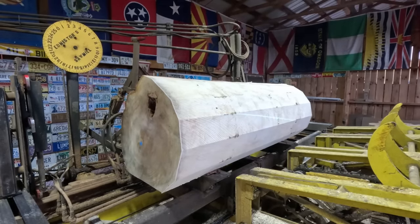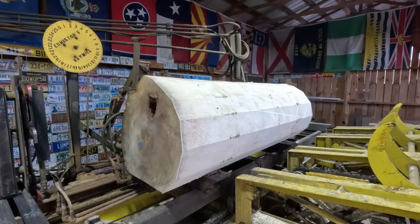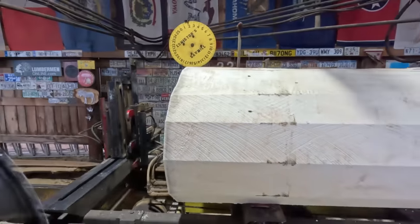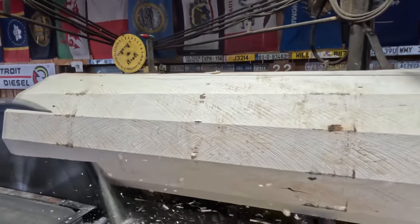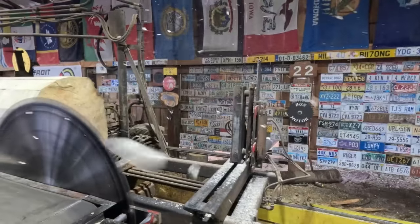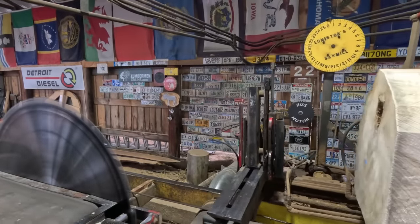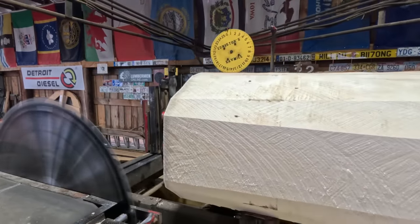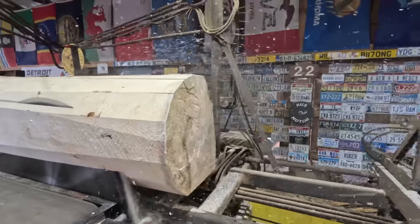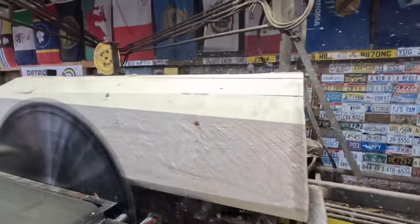And I'm not gonna worry about tapers at this point. Just trying to get a flat spot established. There we go, wedge something out of that. And we slowly get closer to our 22. A magical number. Is that 1 inch thick? That's inch and an eighth. Inch and an eighth, okay. Which is standard, what they call 4/4 in the industry.